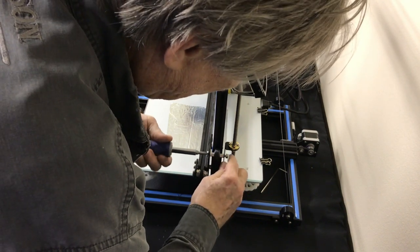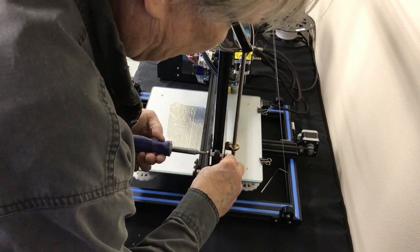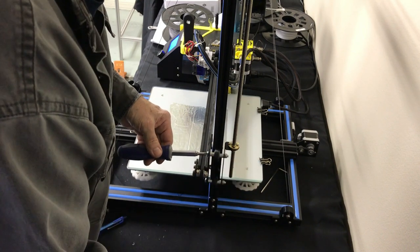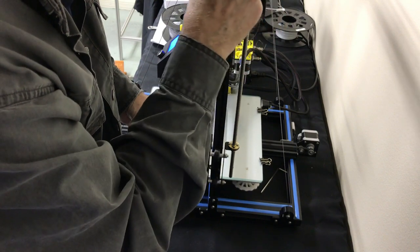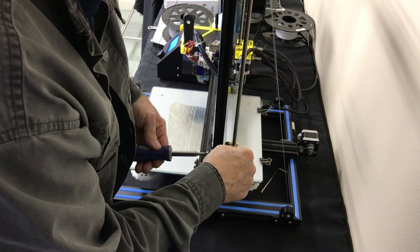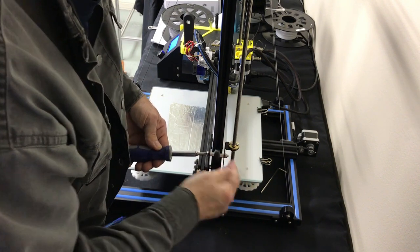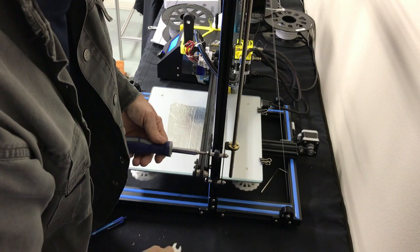Okay, and right now you're gonna get that nut where it's contacting the bracket. Some of you may get their brackets and say, this bracket isn't made out of eighth inch steel, stamped steel. What's up with that? That's because when this nut goes up here, there's different forces that this encounters. This screw may be a little further away from it. Rather than put pressure on this and the bearings and the nut, the bracket will slightly flex. I don't know if you can see that. The bracket will flex to conform to those pressures. It's just the way to do it.